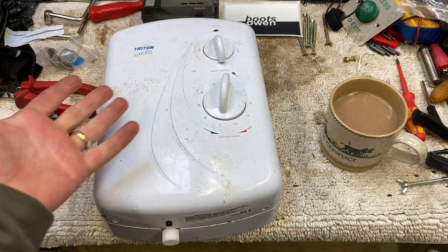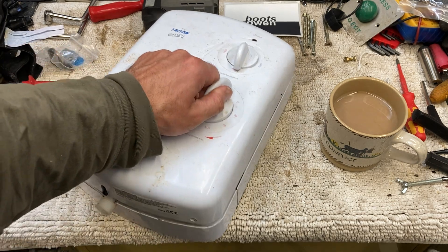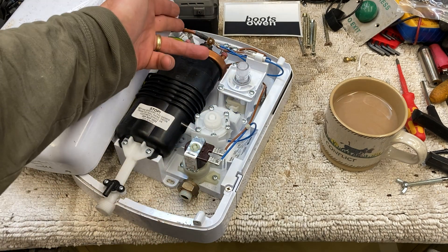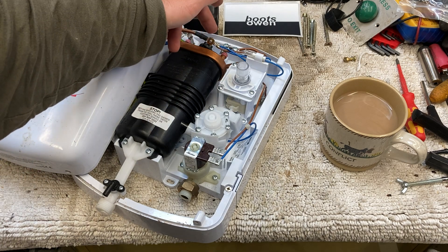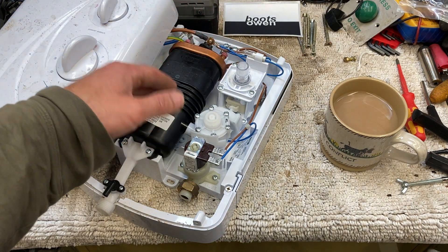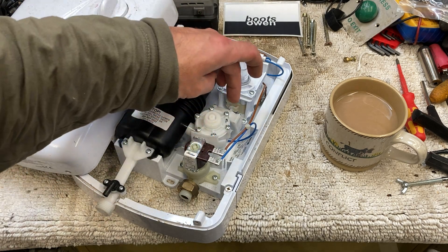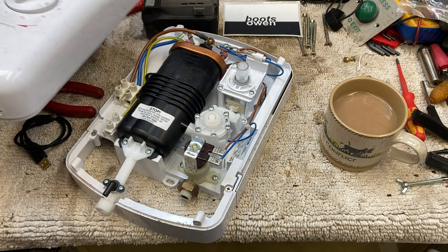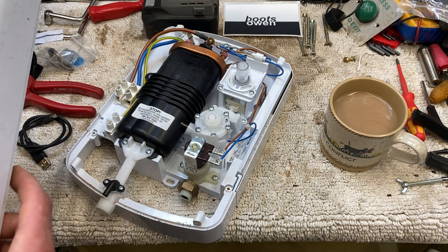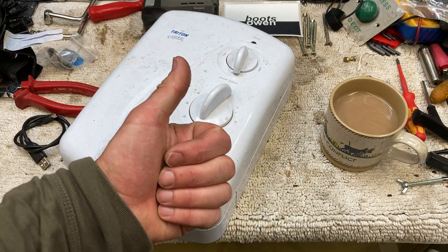Questions or comments, leave them below. Hopefully that was helpful if you're wondering what's wrong with your shower. The fault-finding should be quite obvious if you give it a moment to think about it. If you've got no water, this solenoid could be out, or the switch driving it could be out, or the power to the machine could be out. If you've got no heat, the thermal fuse is probably your issue, or the element could be burnt out. Your flow regulator — if it's not changing temperature — could be the issue, and the pressure valve in there could be gone if it won't get hot, because it won't be allowed to get hot but it will be allowed to turn on. Questions or comments, leave them below. Thanks for watching, see you later.